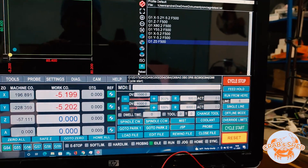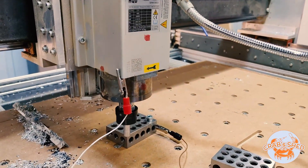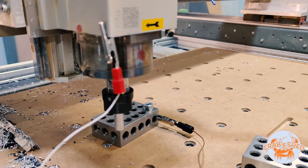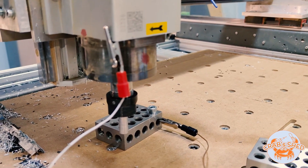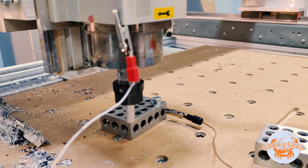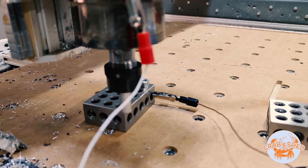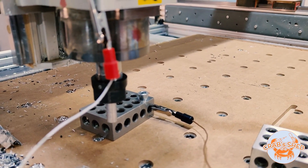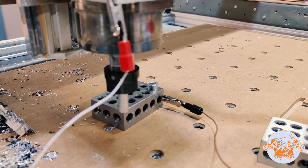This should help me find the XY zero for some more difficult parts which do not have circular features around which you can rotate the G-code. It can also be rotated around the part center point, but that might be problematic to find on some pieces. So this will give me an exact calculated point which can be used for this purpose, and it works just great. Thanks for watching.